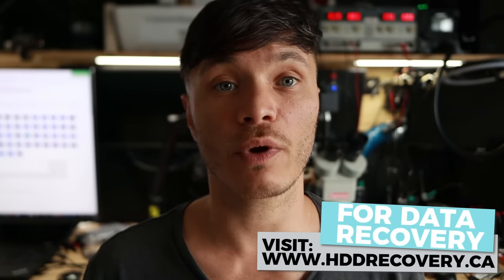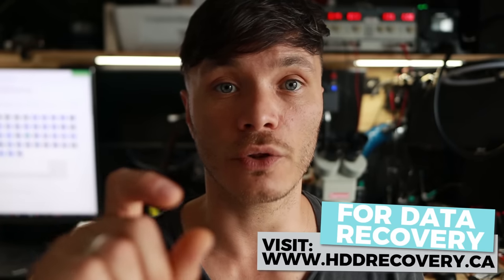What's going on guys? Just like the last video where I demonstrated those solder lugs being super helpful, in this episode we're going to talk about this tool. This cold spray is definitely a must-have if you're doing any sort of electronic work or data recovery. It can help you detect where the shorted components are, improve the quality of the read on some stubborn chips, and it can also help you in situations like the one I was facing today. I was this close to throwing in the towel, but that little bottle changed everything and the recovery went from red to green.